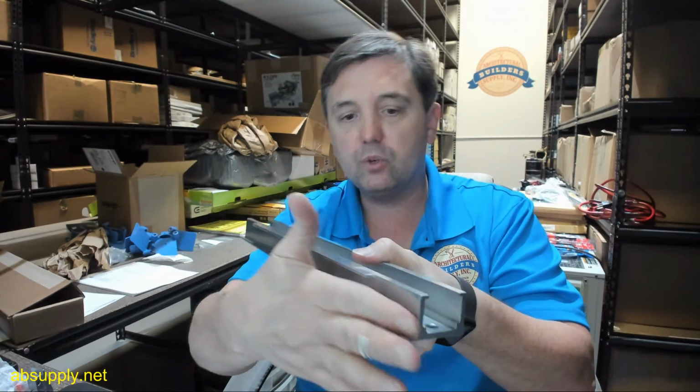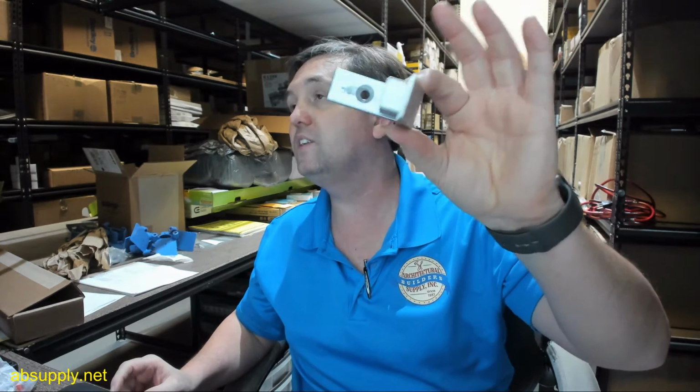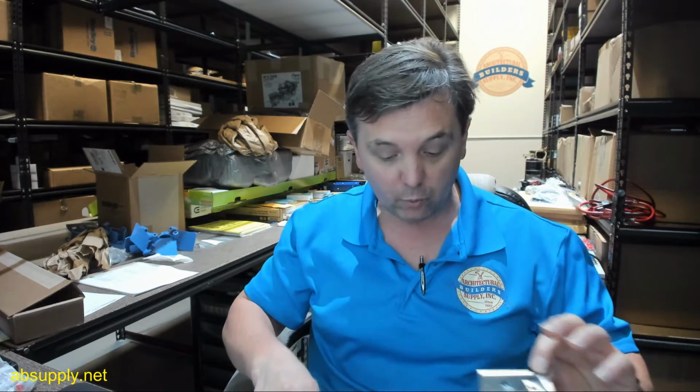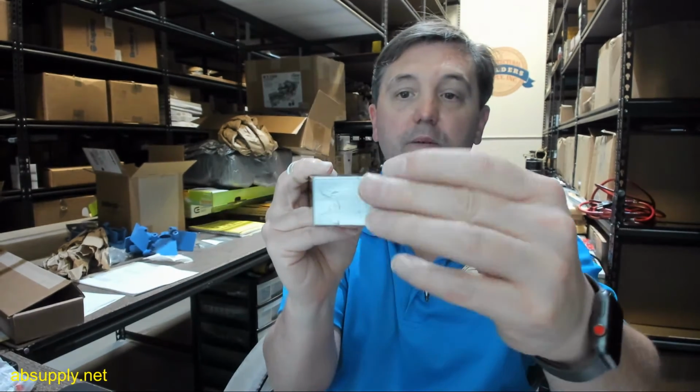This is the face that will go to the door. Okay, this is what you'll see exactly from the exterior. This is going to feature a couple of end brackets. And what you do according to the installation table there is you are going to mount the two brackets to the face of the door according to the X and then the D dimension, 9 inch over and then 13 1/4 center to center, and get these two items mounted up to the appropriate height of the unit as well. That's very important. And then once the two end brackets are mounted to the face of the door, you will then literally mount the track to the end brackets, and it's going to end up looking just like that.